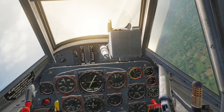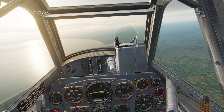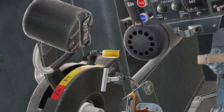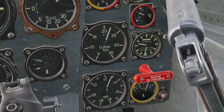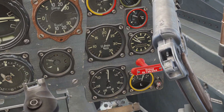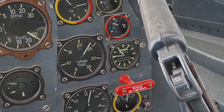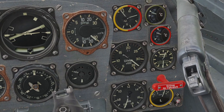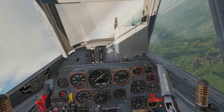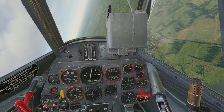The only time I would put it in manual mode is during takeoff and landing, because you want the blade to be at the least angle possible. You can put it to manual mode and then use this little switch on the throttle to manually adjust the angle of the propeller blades. When taking off and landing, you want the gauge to read 1230 — that's the least angle you can have and it's good for takeoff and landing. Otherwise, put it back to automatic mode and it will adjust automatically.